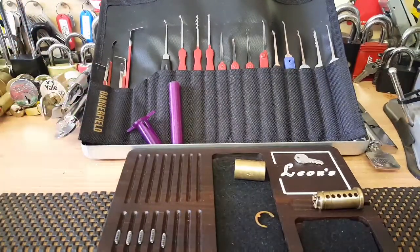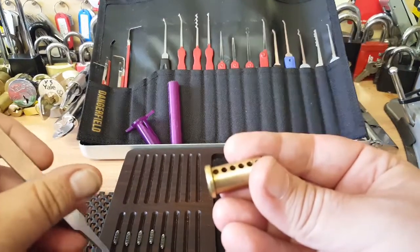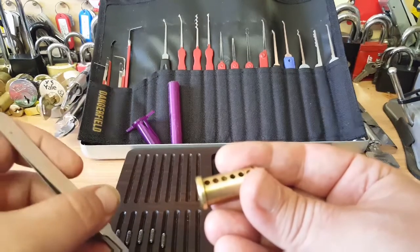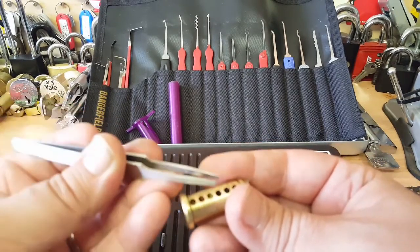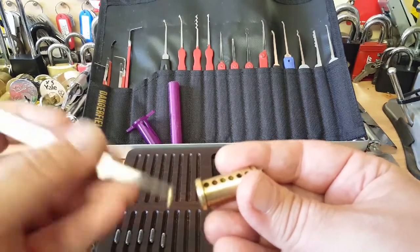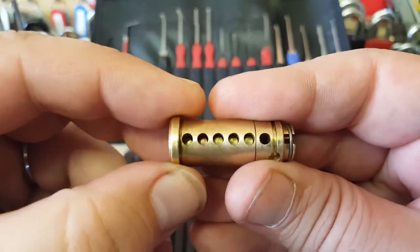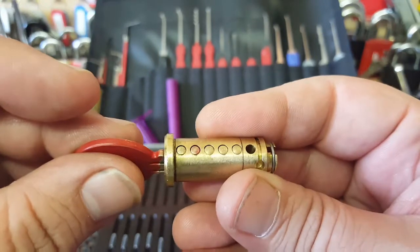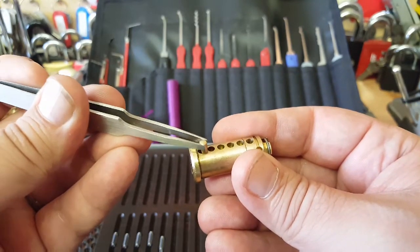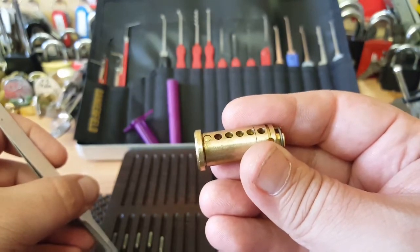What I'll do is put all the key pins back in and show you what I mean. When you've got your lock and you've gutted it, if you haven't got the tools to do a tap and die set or any threading or make your own, you can make challenge locks just by using a collection of security pins from other locks. You can see they're all deep. If you put the key in - there we go. I'll put the standard driver in - watch how low that driver goes. That driver doesn't even actually have to be picked - that's why it's a false set.